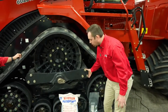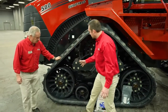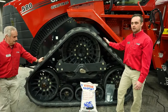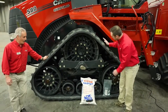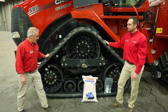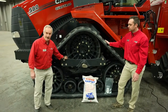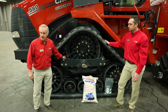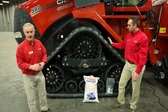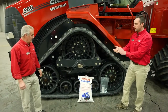Basically, these 6 bolts on this yoke plate will need to be loosened, and we have our adjustment bolt here, which is going to move this yoke plate back and forth. That's how we move the track in or out, depending on which way we need to go. But as good practice, check the temperature of the internal drive lugs and make sure they're warming up evenly. Another good practice is to grab your big sledgehammer and beat on here, because that tends to rust in between the two over here. If you give it a good whack, it'll break it loose, ensuring the yoke plate is moving freely. Perfect. So I think we're good with our tracks, Louis.